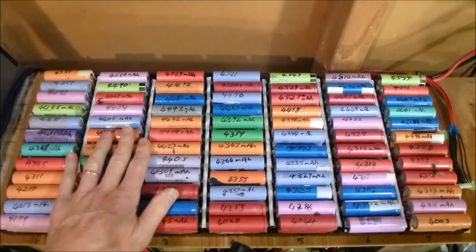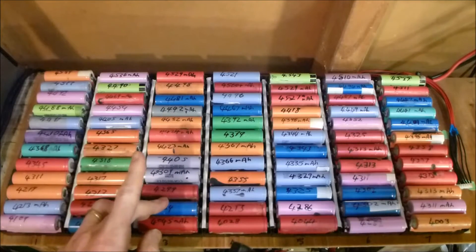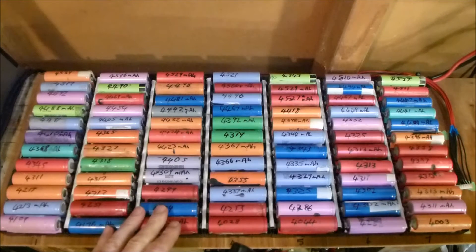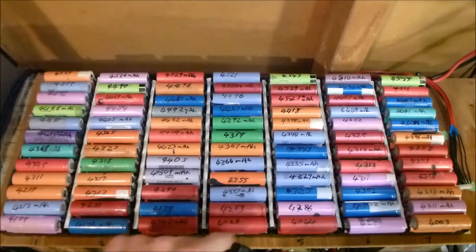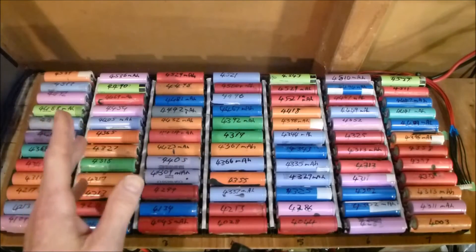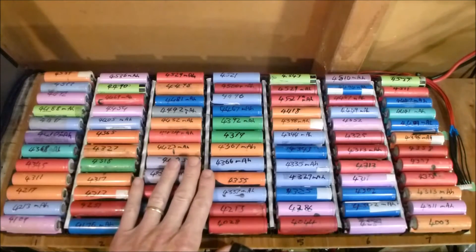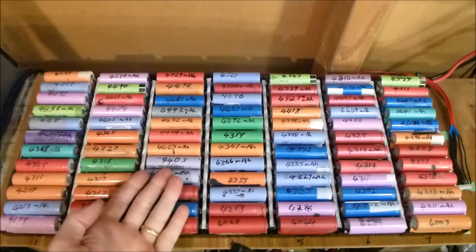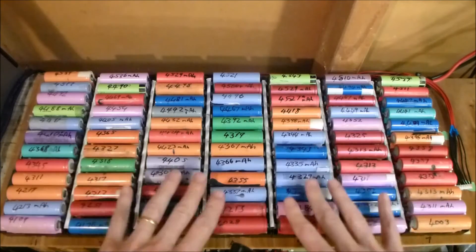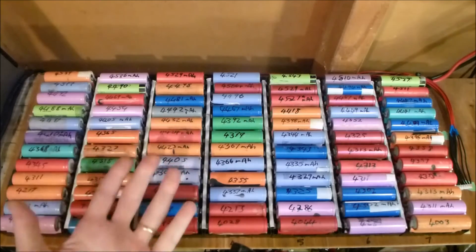Pros of the power shelf: you can buy the battery holders from eBay or AliExpress, whereas with the small blocks you have to have a 3D printer of your own, or know someone who's got one, or pay for 3D printing services. The big thing about the power shelf is you can swap the cells or groups at any time — that's the critical benefit over any system where everything is soldered in. Another benefit is that it's a much better design for a server rack. If you're not going to be mounting it on a wall, having shelves of these on a rack would be better than the small blocks, although you can put the small blocks on a server too. This design is just fundamentally more shelf-like.